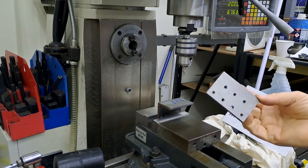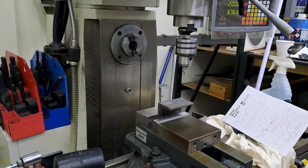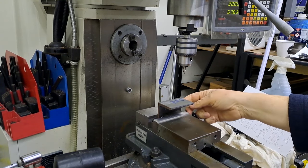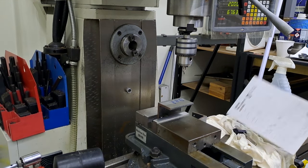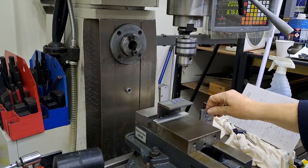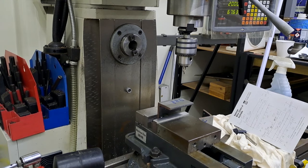There's the second one with the hole pattern already drilled in it for the bolts that hold it to the frames. In this face they'll be going the holes for the rivets that hold it to the pump stay itself. This is set up in the vise, done the zeros as usual from the corner of the vise — by default the corner of the vise is zero zero. Got the trusty little drawing by my side, all the dimensions worked out. So it's now a case of drilling two rows of four into this, then do the same with that one, two rows of four. Then I've still got to do the angles for the rear buffer beam and the front buffer beam, and then we can get on to some riveting. I think it's a total of 52 holes and 52 rivets of course.